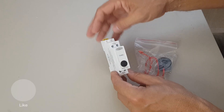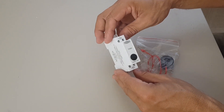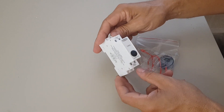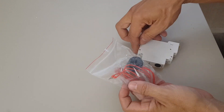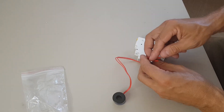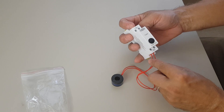This is a standard DIN rail device. Here on the top comes the power — it is a 220 volt AC device. From the schematics, it should also actually work on 120 volt if you want to use this in the United States. And here on the bottom is the CT. It is a very short length of wire, so you have to install this really right next to your surge protectors which you want to monitor.